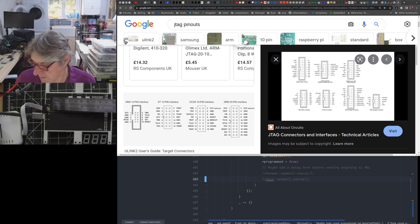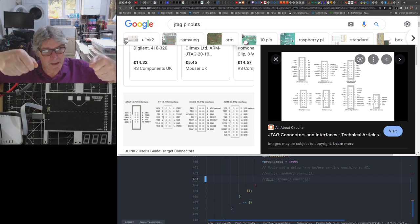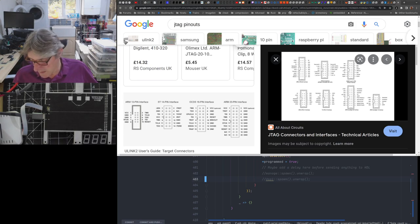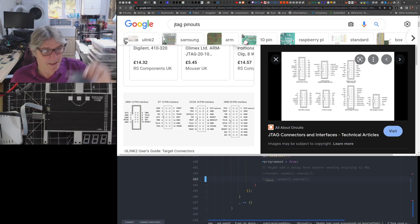One of the pins came loose. They do, because they're in a plastic housing. When you heat this up, it will go through a reflow once, okay, but if you continually heat them up, and if you use something like a heat pencil where you're not really regulating the temperature, it's easy to melt the pins, and then when you put it in, the pin can just bend up because it's basically in plastic that's slightly soft or molten because of the temperature. But it works. Hurrah. Thank goodness. I won't be using these sorts of connectors anyhow.